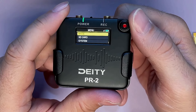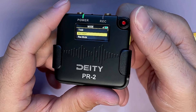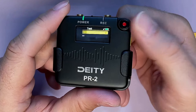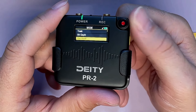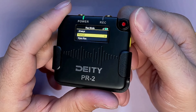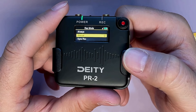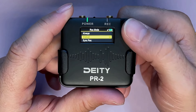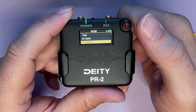Bluetooth on or off, mode, track — mono or stereo. Bit depth: 24 or 32 — I've got it set to 32. Record mode is set to 'always,' so as soon as you turn this thing on it starts recording. In manual mode, you actually have to push the record button on the wheel. There's also sync recording and timecode settings.